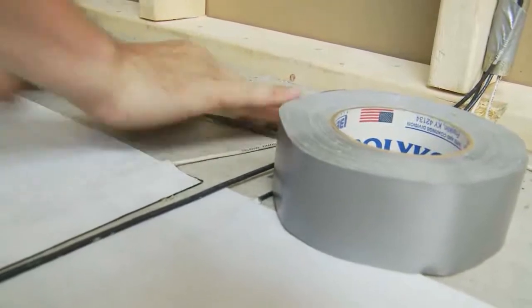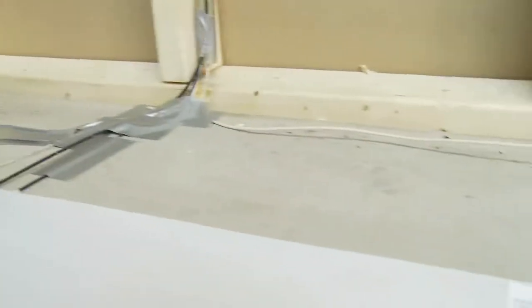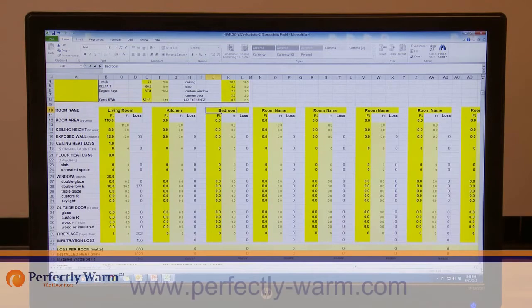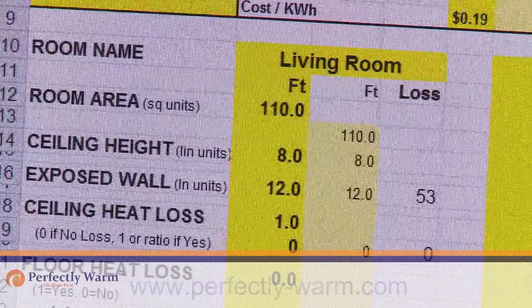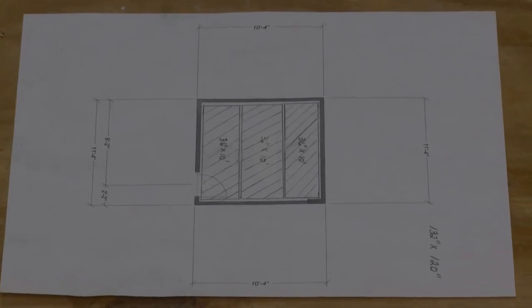Near fireplaces, wood stoves, etc., at least 8 inches of clearance must be maintained. The tile floor heating mats cannot be cut or notched to fit around any obstructions or penetrations, such as door openings or floor registers. A heat loss calculation must be completed if primary heating is desired, to determine the energy required to adequately heat the space. It is good practice to plan your installation using a sketch, marking your layout pattern and planning the positions for floor sensor, electrical mains connection, and thermostat.